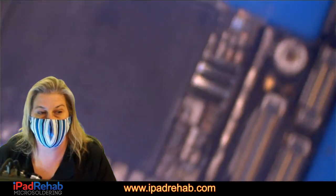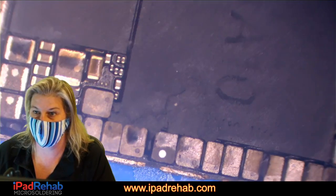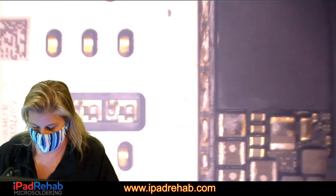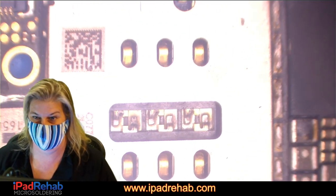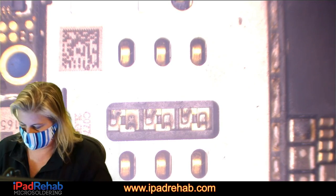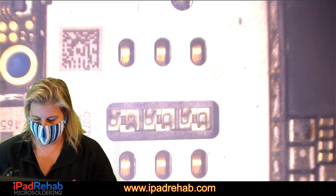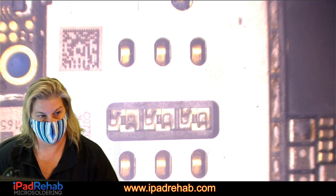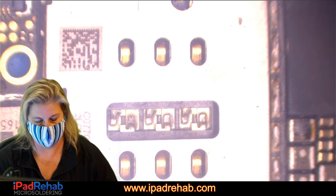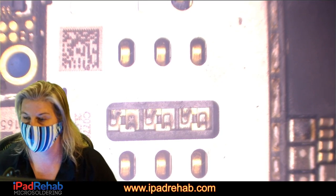All right, let's see what happens if we ask this phone to just ignore the 200 milliamp leak, which is a lot. Usually a phone can't ignore a 200 milliamp leak, but we're going to ask it to ignore it and prompt it to boot. And then maybe we'll see a hotspot that might give us a hint on what system really is a fail. But we need to wake up this camera first. Let's try to do that.